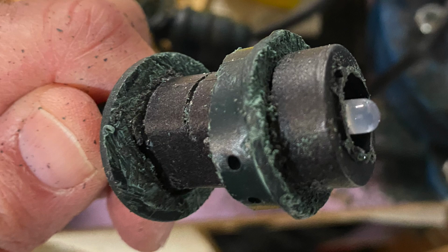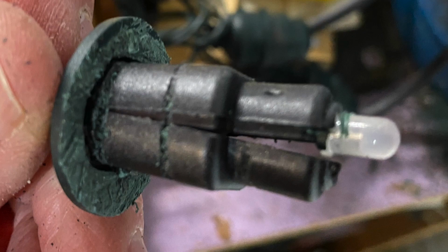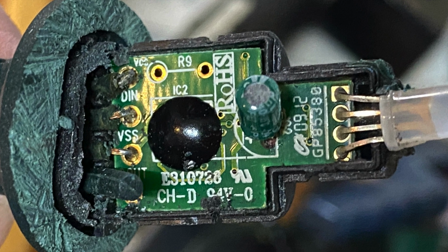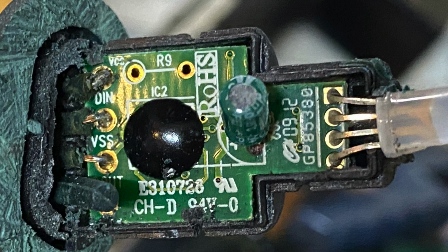The key thing about this insert molding is that there's a container at the core that is covered by the molding. Thus, while I was sawing through the molding, I could hear when I'd hit that hard plastic container, and then I could rotate the saw around to make sure I'm just cutting through molding and not into the container. Obviously, I didn't want to cut through the container for fear I'd cut into the PCB inside. Once the molding was off, the container could be cut or pried open to reveal the PCB.